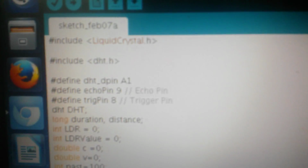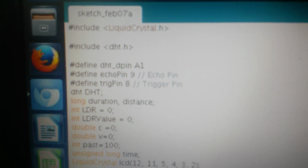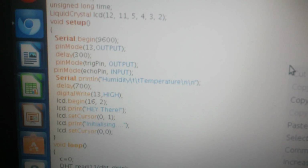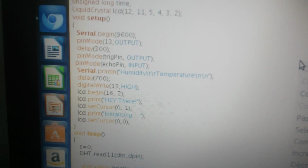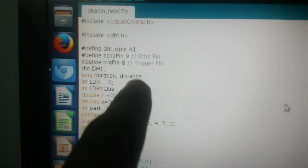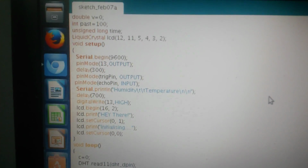So here is the code. I have included the liquid crystal display library, that is LiquidCrystal.h. I have included dht.h. This is the library for the temperature humidity sensor. I have defined the initial pins. In the void setup, I have done my initial settings. I have given the output on the pin mode. Like for the ultrasonic sensor, I have given the output on the trigger pin, and the trigger pin is my pin number 8. With this, I have initialized all my components, and in the loop which would continue infinitely, I have calculated my various things. I have displayed it on the LCD. I have uploaded this code on my GitHub, and I have shared the link in the description. So if you want to see the code, you can click on the link in the description.